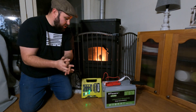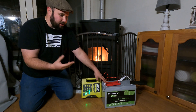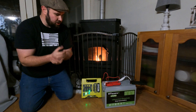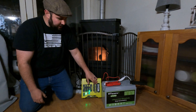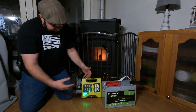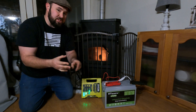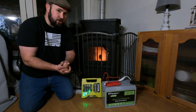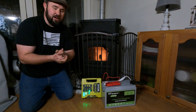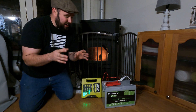This battery is a 100 amp-hour at 12 volts, so it's a 1,200 watt-hour battery. The inverter does 800 watts max, but that's just peak capacity. Running at around 180 watts steady, if we average it out to about 200 watts, that's 6 hours of theoretical run time. You're probably only going to get about 90% out of the battery, so realistically you're looking at about 5 to 5.5 hours of run time on this battery running the pellet stove — a pretty safe estimate.